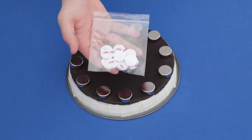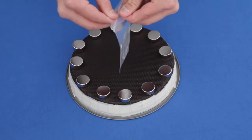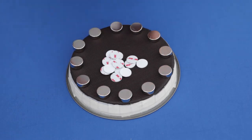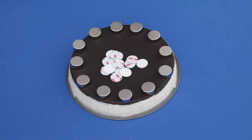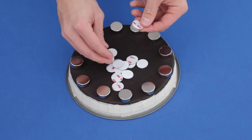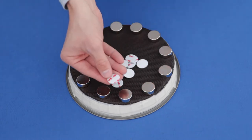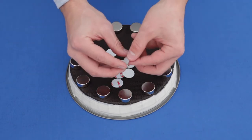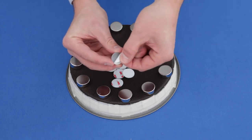Once you've gone around and properly cleaned each magnet, go ahead and grab that new pack of adhesive as we will begin pre-applying them to the correct side of the magnet. In this step, be super careful that you do not touch the exposed adhesive with your skin, as it will strip your fingers of their natural oils and compromise the integrity of the adhesive.